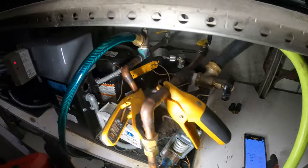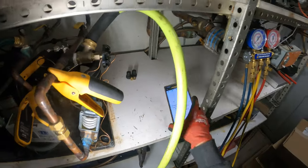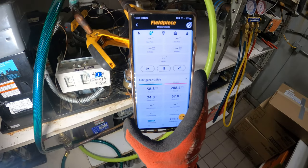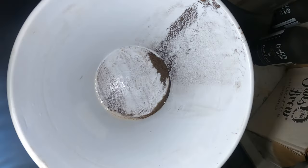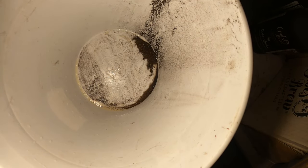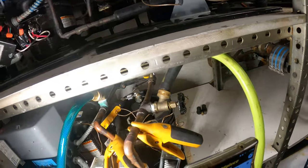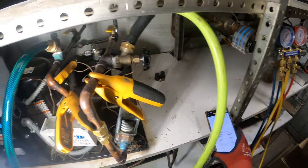It's staying on. We're holding at 210 and the back pressure is coming down as the box gets colder. Look at all the dirt still accumulated in this bucket — there was definitely something in this water. These units need strainers. None of the units here have strainers — that is unbelievable.